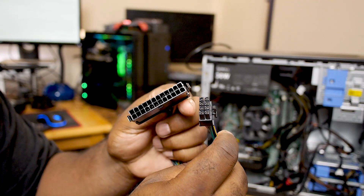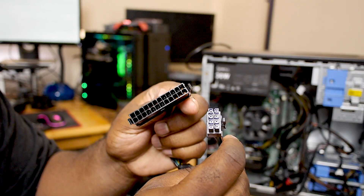I tried everything, then I remembered something I actually used at work — we've had systems like this before. You pick up one of these adapters. This is a 24-to-8-pin adapter. You plug your power supply in on one side, plug this into the motherboard, and boom, you're good to go.